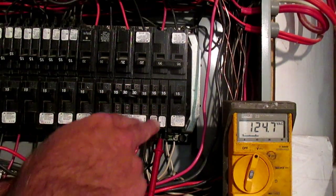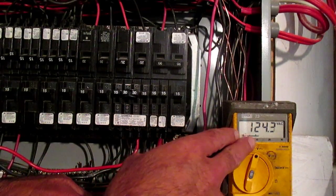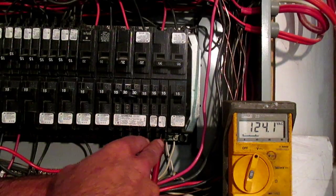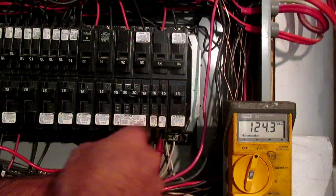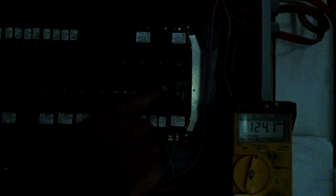What I'm going to do is power these circuit breakers off. I have one lead of my meter on the ground bar and the other one on one of our 15 amp breakers. So if I pop this one down, it's not going to kill the voltage on that meter, but it does kill the lights in this room. And now when I power this breaker off, we should see that our meter voltage goes to zero. And I can power this breaker off — there's nothing wired to it anyway.